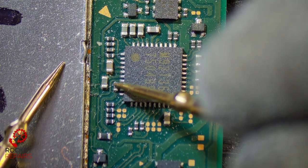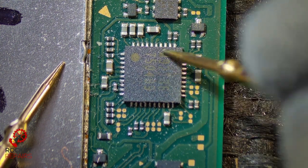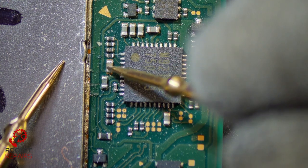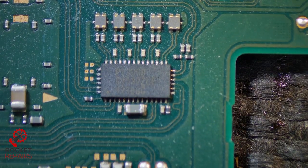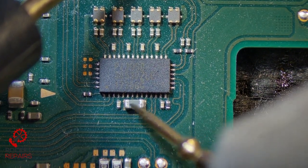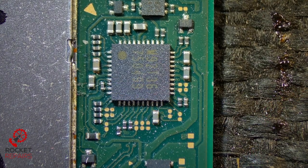This cap is shorted here. So that could be a bad M92 on this little one here. I'm pretty sure this one is P13 USB, and it seems to be okay. If I just turn this around to the back to confirm that P13 USB is alright — it's still in continuity mode — and yeah, that's absolutely fine. I'm just going to take M92 T36 off the board to see if it alleviates this short.